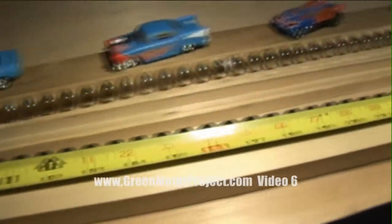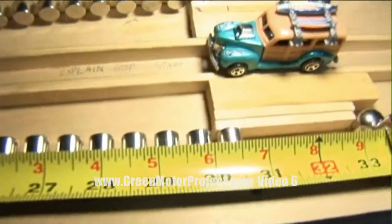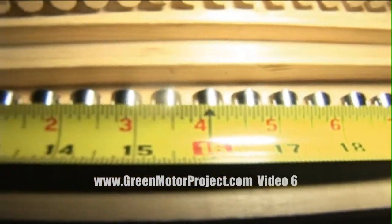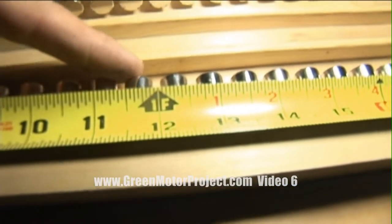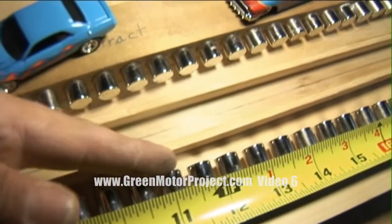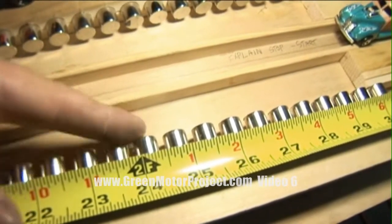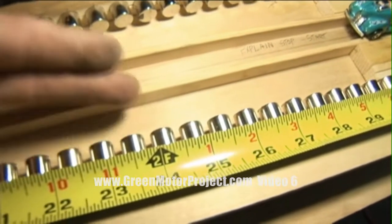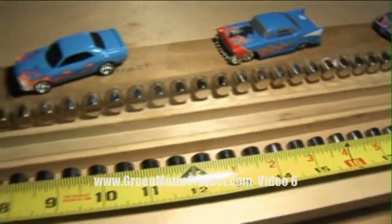The length of the fields are approximately 30 inches from where the magnets start to where the magnets end, and the rise is approximately one half inch at the 12 inch point right here. So at about the 24 inch mark we've got about an inch of space. So these magnets are out of parallel — one half inch in every 12 inches, or in every foot.